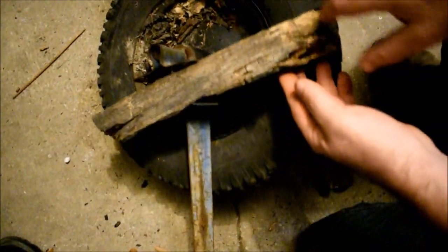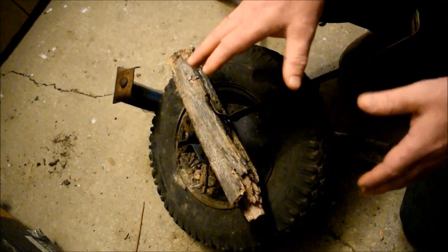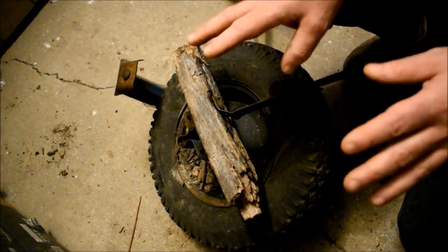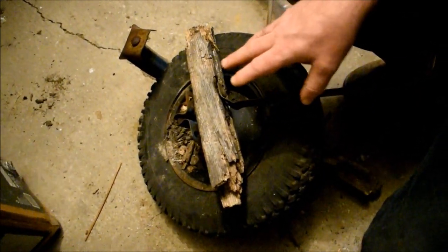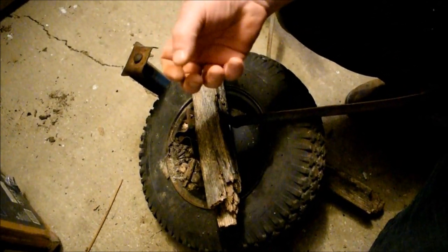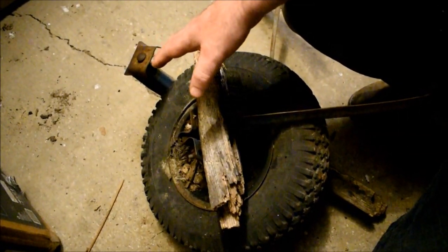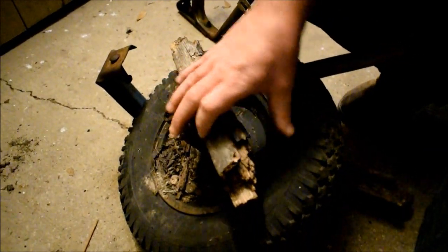For those of you who need a reference guide to what these handles are, we've taken a measurement before, and I think they are exactly 5 foot long based on what they sell today. And there's two different types of handle. One is a little bit weaker and skinnier for a lighter duty wheelbarrow, and one is a heavier duty grade. And your standard size diameter square until it tapers to a handle at the end is, I think, roughly 2 inches or slightly down from there. So 1 inch and 7/8 maybe. About 1 inch and 7/8 square. So square to square, inch and 7/8.